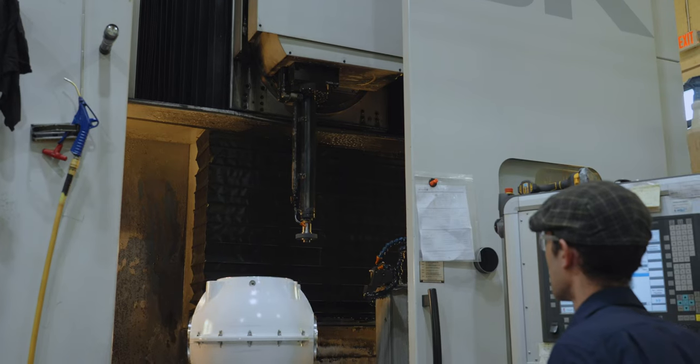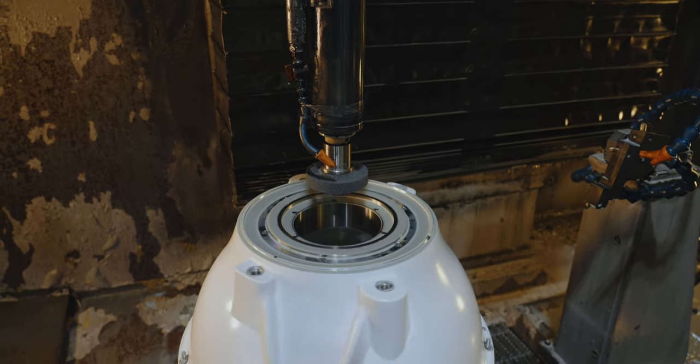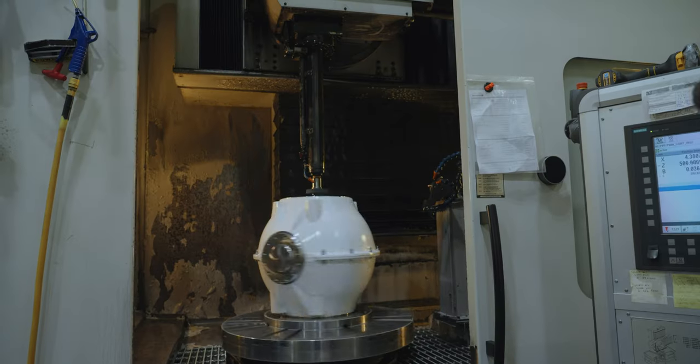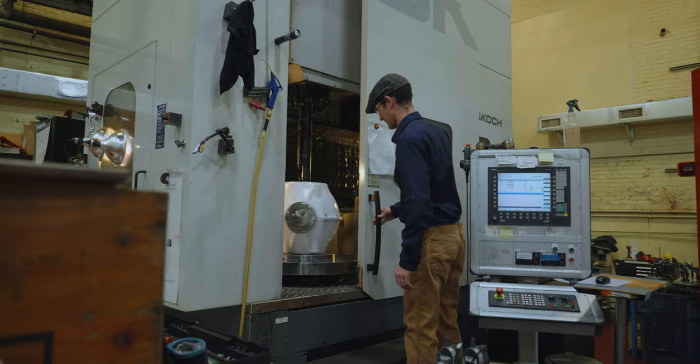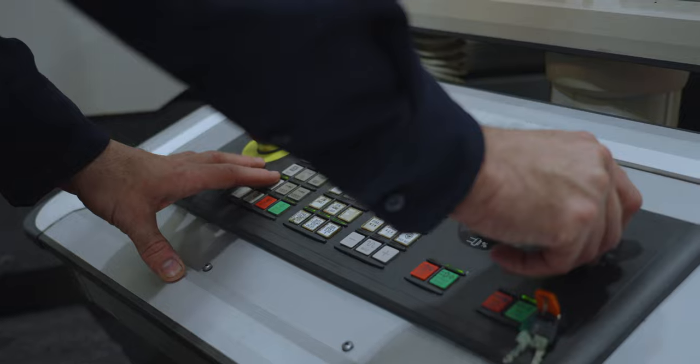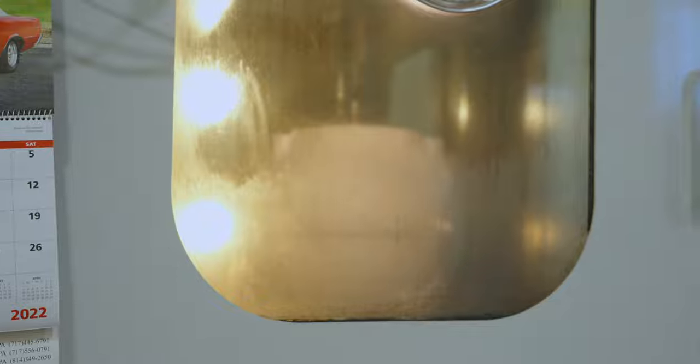While the flywheels are being prepared in a separate area, the aluminum casted enclosures are also getting ready. The critical step for the enclosure preparation is a vertical grind to the top and bottom of the enclosure. This is to maintain a critical tolerance of the enclosure to bearing fit. This precision is so important that each enclosure is paired to a specific and serialized flywheel subassembly, as we saw before. This plays a key role in the longevity of the product while allowing it to operate under extreme loads out on the ocean.